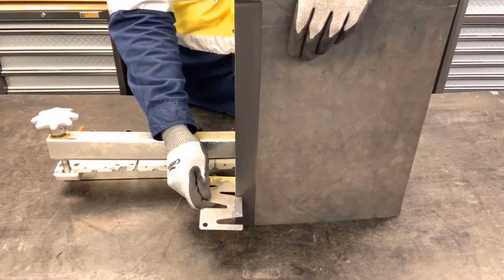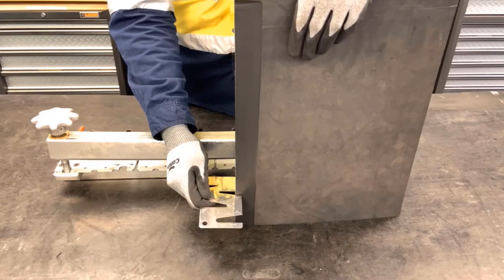Whenever using a power rivet driver, always use the smaller rivet. Sometimes, if the belt is worn, we may need to use two or three different rivet sizes throughout the belt width.